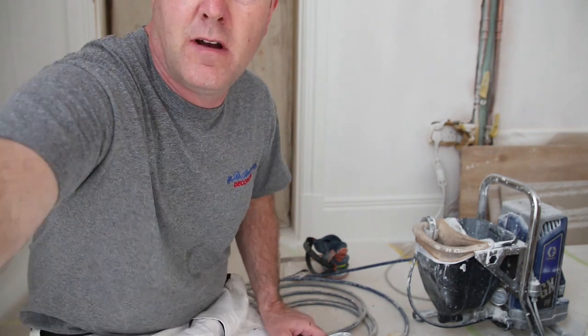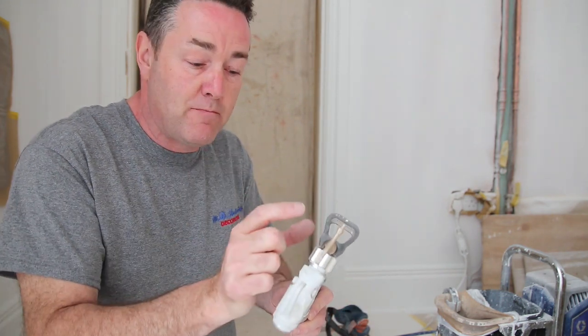Now I find, and again, you're going to give me some comments. Am I doing it wrong? Am I not doing it wrong? Am I giving you a tip that you think, oh, that's a good idea, let's try that. You might have a long length of skirting that you can't do all in one sweep. You might have a narrow fan pattern. This is a 110, so that's giving you roughly about a 2 inch spray fan.